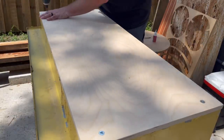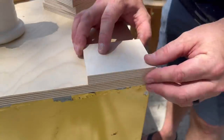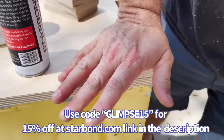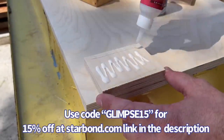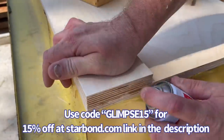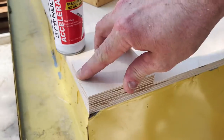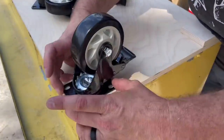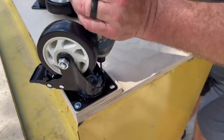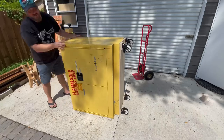It's definitely great to have a wooden base to build up from. I'm taking some Baltic birch scrap pieces and putting them on the corners. A little glue and CA glue trick to get everything nice and flush and attached. This trick basically uses the CA glue as a tool — more like a clamp than anything else. Once it sets up for about 20 seconds the piece isn't going anywhere. The reason we doubled up the material is because when I put castors on anything I like to use at least one-inch screws, and I like having all that material to screw into for a good strong hold. Once everything's in, it's time to flip this bad boy over and bring it into the shop.